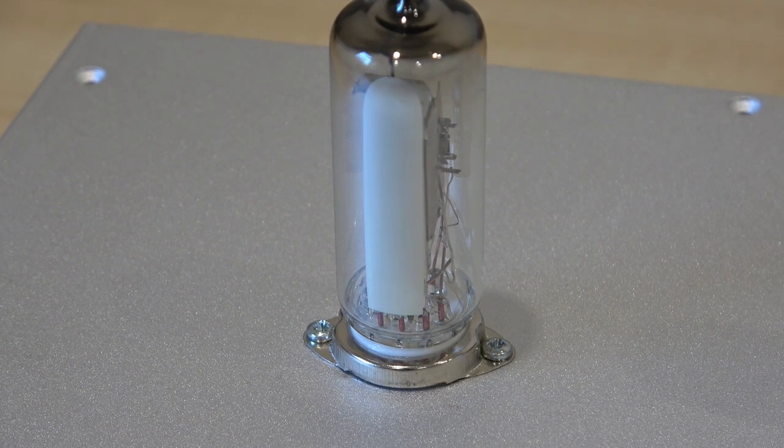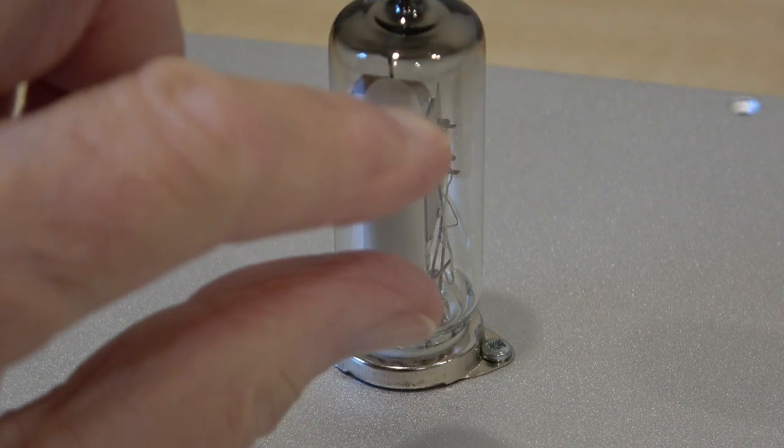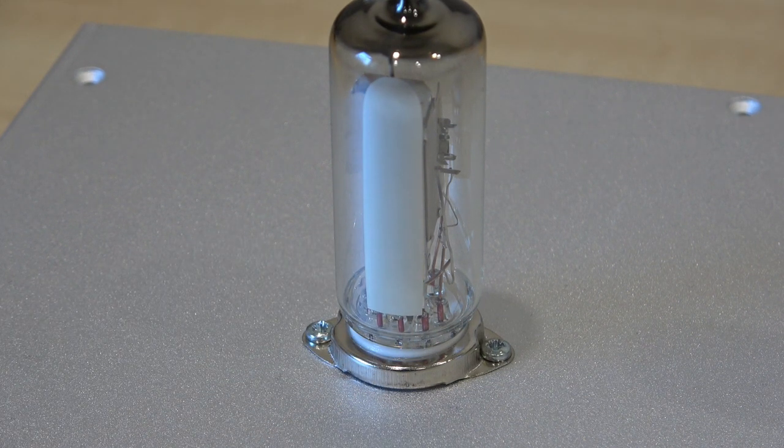Ironically, the area I've had the most problems with has nothing to do with sound — it's the magic eyes. When I first received them, one was faulty: instead of a proper display, there was a weird mess down one side. I initially thought I'd made a mistake on the preamp board, so I swapped the valves over — which luckily you can do with stereo — and the fault obviously traveled to the other channel. So I clearly had a faulty valve. I must say the supplier of the magic eye project parts supplied a replacement very quickly, and at that stage I thought it would be a good idea to get a couple of spare magic eyes in stock.